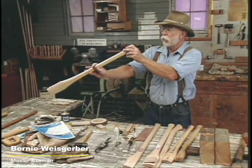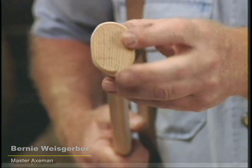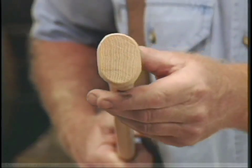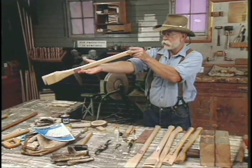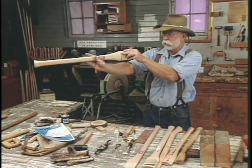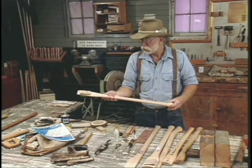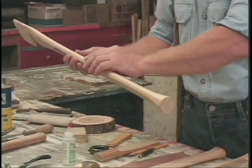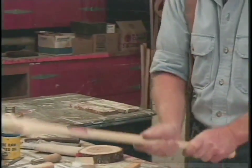Percussion handles. What I'm doing now is looking to see if the grain is correct. The grain runs this way in a proper handle, and I want to see how straight the handle is. This one looks really good. Now this is a double bit handle and it's a slim taper octagonal — you can see it's got flats cut on it, and that helps you get purchase.